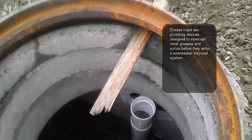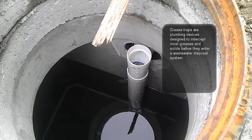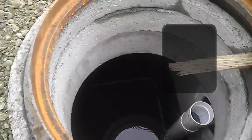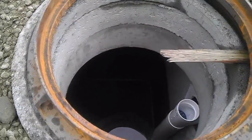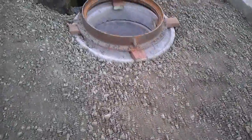You can see where the water is flowing on this pipe right now. Basically what happens is the greasy water coming from the kitchen area will go to this section of the grease interceptor, collect in there, and have all the grease collect.